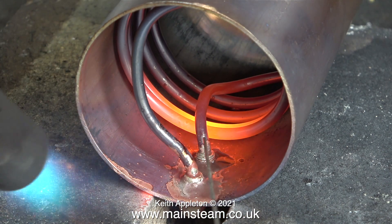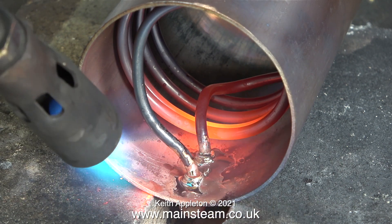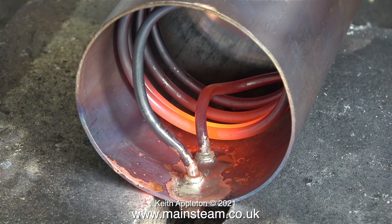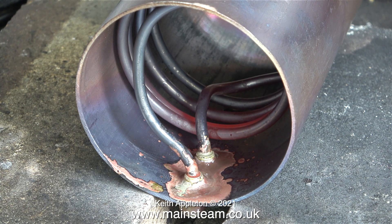I once made a Windermere kettle with a very small, very fine coil inside it and I did just about the same thing — I melted every bit of the copper coil. But by backing off the heat occasionally and trying to focus most of the heat on the joint, this copper coil was alright. It's quite important not to quench this — just let it cool naturally.